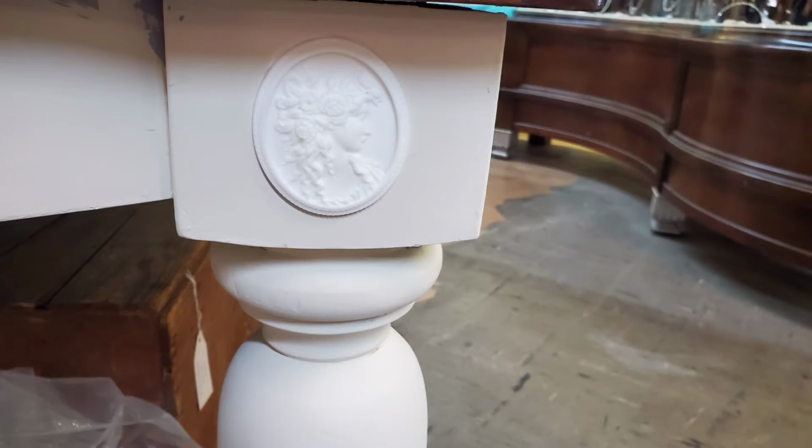So I got a little more gray on this side, so I'm mixing in a little bit more Tobacco Road, a little more black. I just do it to get that striation back in. This will dry a lot faster. It takes days for the oil-based no pain gel stain to dry, but this is water-based. Like I said, it's kind of more like thinned down paint, so it goes a lot faster. It really dries fast. So I'm pretty happy with my results so far.